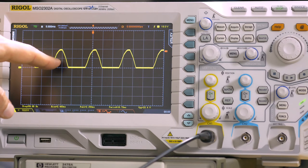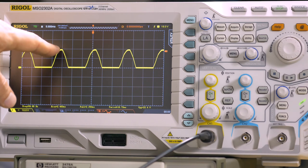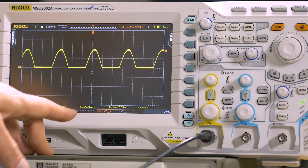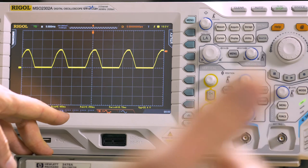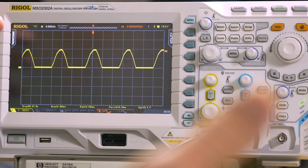However, this isn't very useful. If you have something oscillating between zero volts and 20 volts — even though it's always positive — doing that 60 times a second, that's not going to be consistent for whatever embedded system or device you're trying to power. So we're going to have to do something with that, and that is where the filtering comes in.